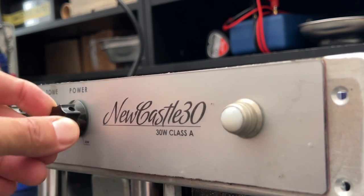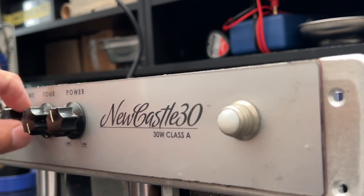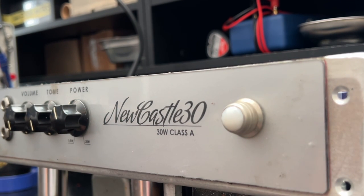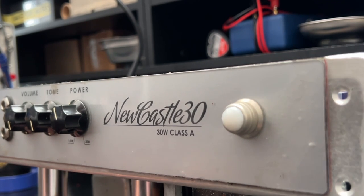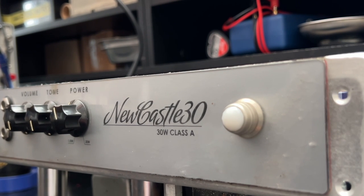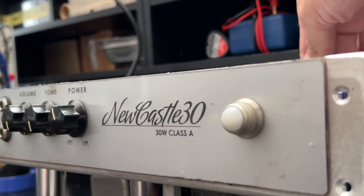This thing has power scaling, one volume control, and one tone control. The power scaling knob is not aligned to the indication marks there on the front control panel — the faceplate, as it were. She is now on the current limited power supply. We're going to test her at 115 volts from the variable power supply. Let's get her warming up.